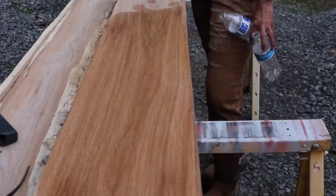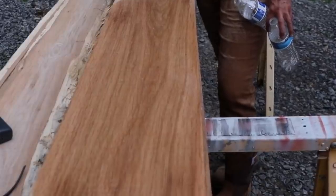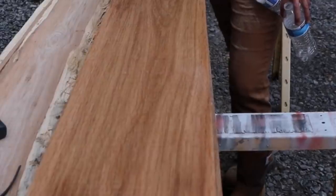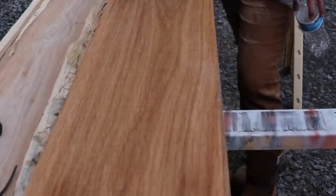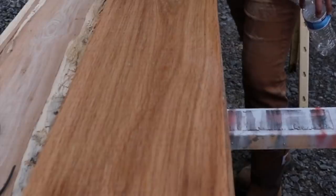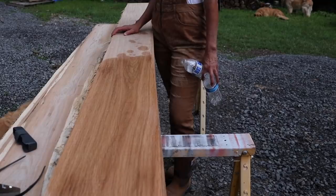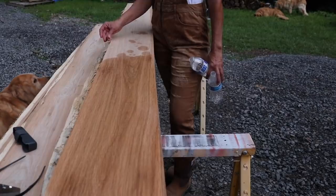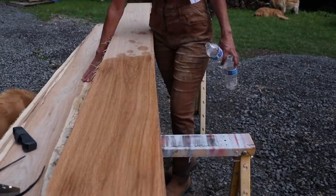Now what I did, I sawed right through the center of that tree. So I have some quarter sawn down in this pile, but I'll have to cut that pith out of the center. So we'll end up with just four-inch wide boards or something quarter sawn. That one wasn't a real big log. But like I said, we're learning. That's a lot of work pulling those boards off there, isn't it? The awkwardness of the length of it, yeah. But it's kind of rewarding though. You take those old nasty looking logs and put them on there. And these aren't even like splinters. These are real soft. You can feel that. You can even feel this one.